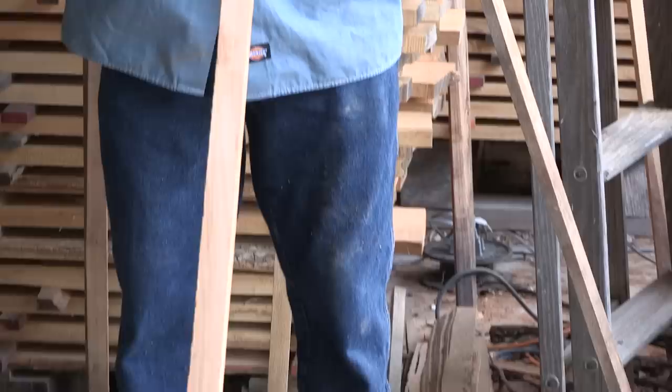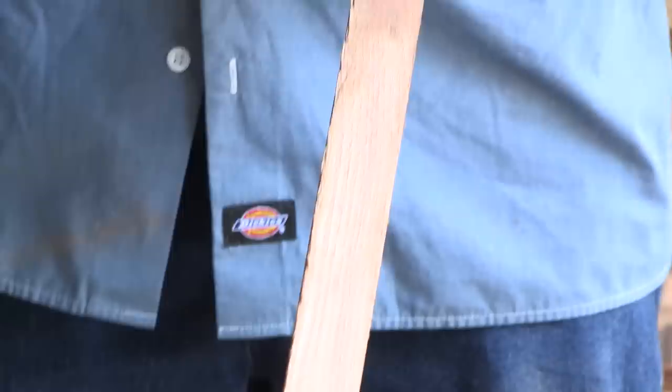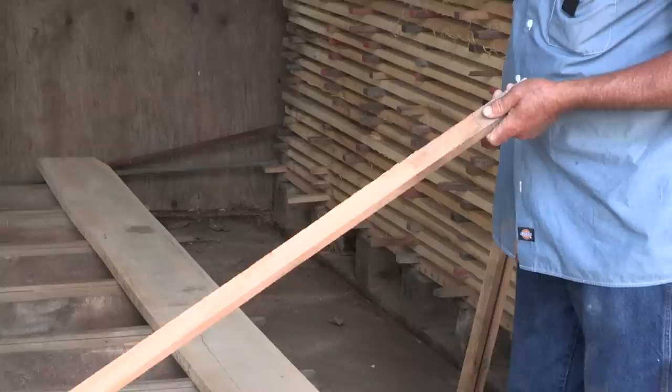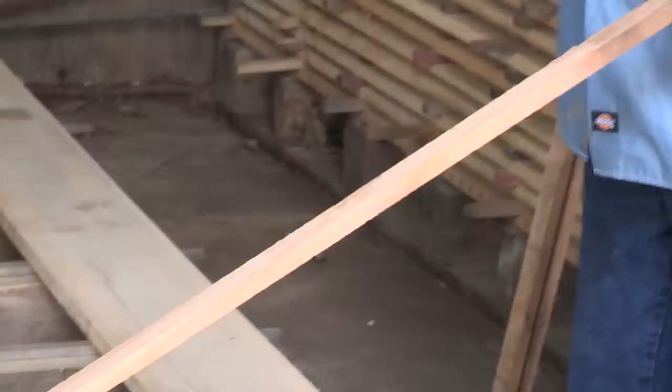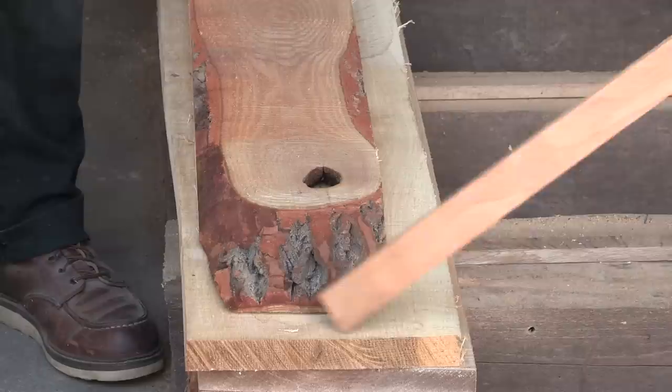Some people talk about sticker stain, and there are several reasons for it. One reason is you want these sticks to be dry. You don't want to take fresh lumber and cut sticks and use them for air drying, because if that stick is wet and the board's wet, where those two interface under poor drying conditions you'll get mold on the surface or color on the surface — and even worse, you can get oxidation stain down below that stick in the board. So it's important to have good sticks, dry sticks — keep them out of the rain, don't let them get wet.